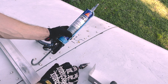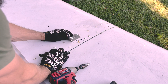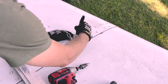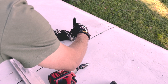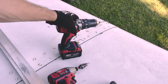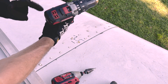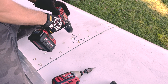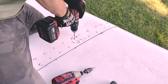At this point you take your bracket, put it in its location, and mark your holes — use a good Sharpie. Now we want to drill. We use a one-eighth bit, and anytime you're drilling metal, make sure you're at slow speed. This is set to speed one — you're going to do slow speed with mid to heavier pressure. That's how you do metal.